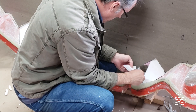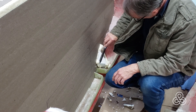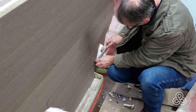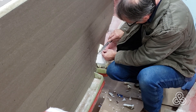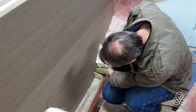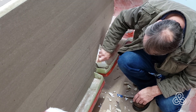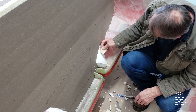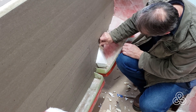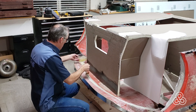The magic of video editing — it's done already. Trial fit complete, and you also miss me gluing it in place. But there it is. Trimming the foam away — same process: glue the foam, trim the foam away so it's nice and clean. And of course always sanding it to get rid of any little jagged pieces that pop up. Any little tiny thing sticking up is going to make a bulge where the fiberglass won't bond — it'll just leave a little air pocket underneath. So sand everything down. Also missing from this video is me vacuuming it out to clean it.